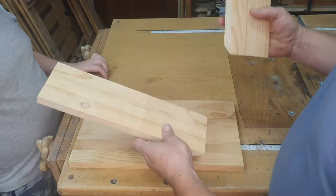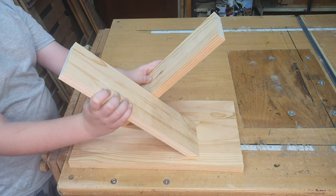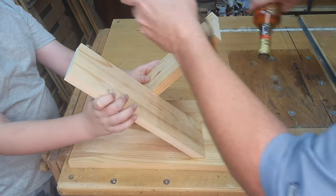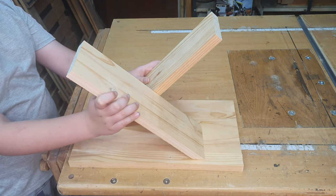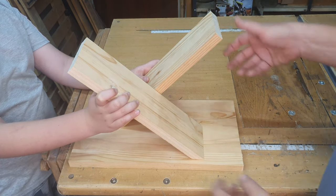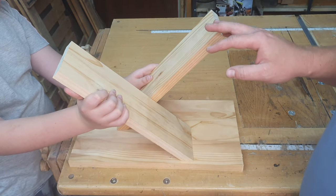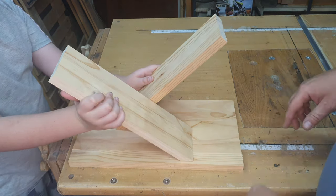There's going to be three holes on this plank and three on that one, slightly bigger than the necks of the bottles. This is going to be mounted on the base as shown. The final result will have bottles placed with three on each side, hanging by their necks through the holes. So let me start cutting the holes into these planks, putting the dowels in, applying the wood glue, rounding over the edges, and then we'll add some decorative touches after fabrication.